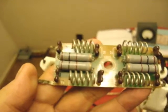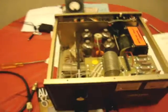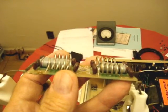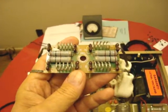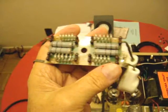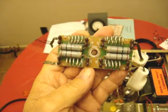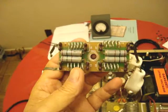Here's a parasitic suppression board out of one of the Ameritron AL-811H's. I wanted to pull it out so the coils could be seen. Notice the turns on these — they have one, two, three, four, five turns — just like the other one I modified. So it's obvious this board doesn't burn up these resistors on 10 meters. This is one of Ameritron's boards that does work, having fewer turns on the coils, along with the 100-ohm 3-watt resistors. Usually no more than five turns on these parasitic chokes — this is a good one.